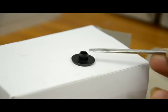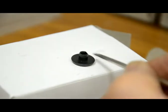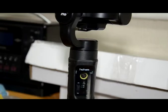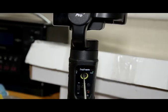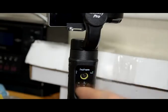On this is the push button for the pan and tilt control. I'll actually chamfer the edges slightly with a very fine file, so that when you operate it on the gimbal unit it tends to go smoothly when it reaches the plastic ring of the control. The chamfers are on the left and the right.